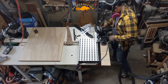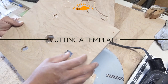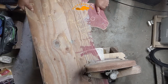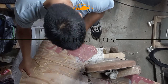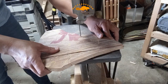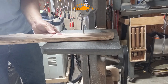From the design, I'll be able to export an SVG, or scalable vector graphic file, so I can cut out this template, which I'll use to lay out onto a big piece of wood and do a rough cut on the bandsaw. I try to get as close as I can to the line because I'll be attaching the template onto the piece of wood and then using a flush trim router bit — so the closer you can get, the better. It just helps.